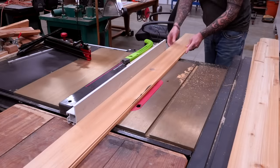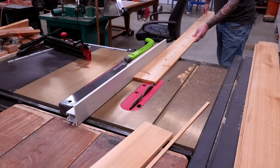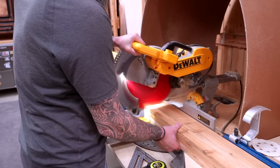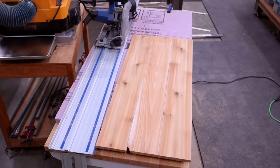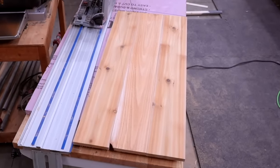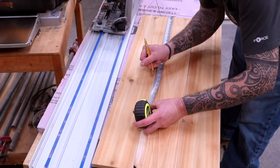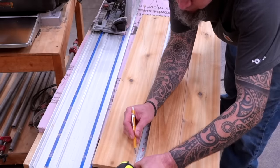For the small trees I'm going to build them just using fence pickets. You can use two by four material if you'd like — I'm just going to show you what they look like using only pickets. For the small ones it's only going to take three sections of pickets that are 35 inches long and cut five inches wide. Just like before we'll find our center and then mark our pocket hole spacing. The spacing for the small ones is two inches, nine inches, 18 inches, 28 inches, and 33 inches.